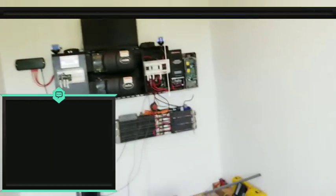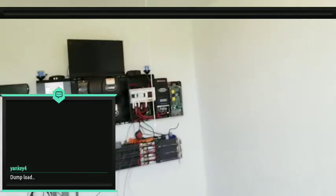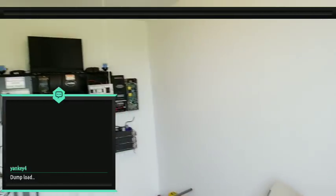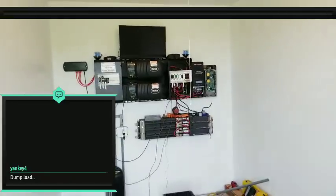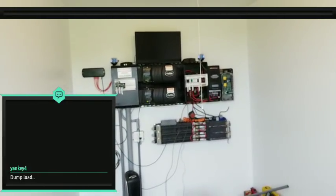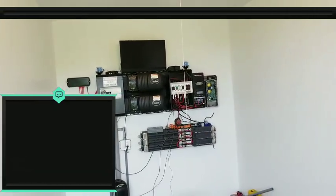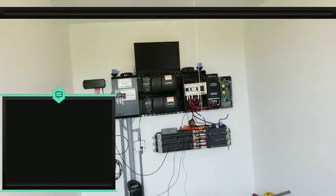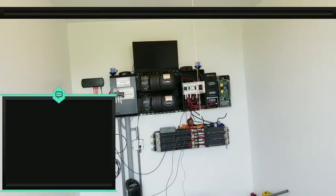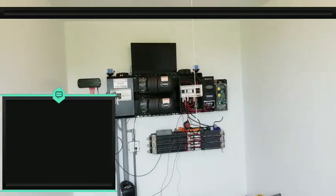Oh, hello. Sorry, Yankee, it's still early in the morning for me. Brain fart. I completely understand what you're saying now. Yeah, I got you. The relay is just a switch in between one of the lines. And the diversion is the signal to trigger that switch. And then your power line that's running to your AC unit is running in between that relay, which is acting as a switch technically. Is that right?